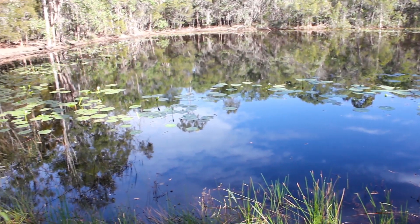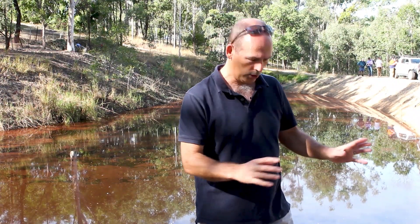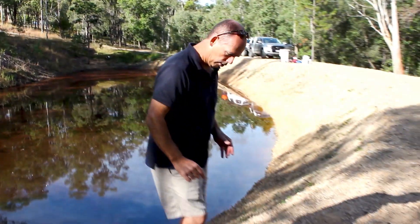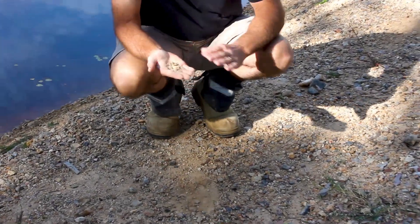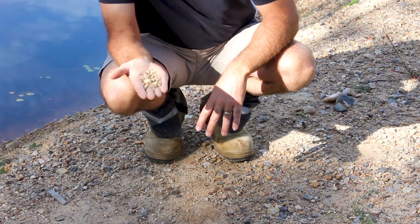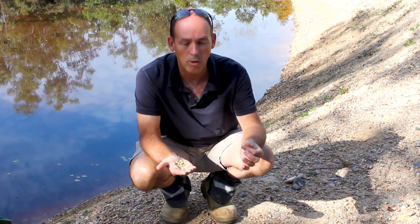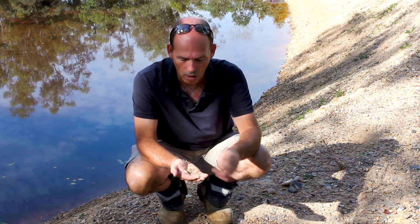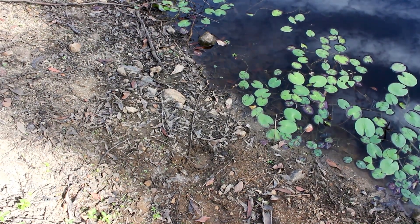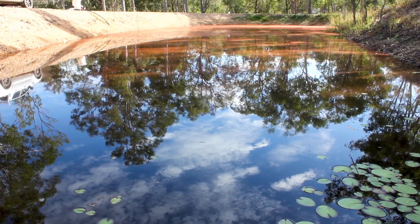This dam used to hold water until all the trees were ripped out and stripped. But if I come and have a look at this material — trying to get an idea of what's actually here — it's just so bony, it's going to be very difficult to hold water. There is a finer clay component, and our polymer works by binding up the clays and silts. There is a nice clay base here, but there's so much gravel and rock that the water tracks along the interface between the rock and the soil, especially when it dries out a little bit.